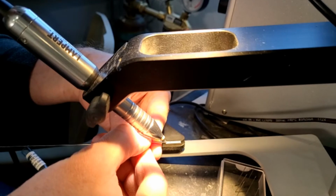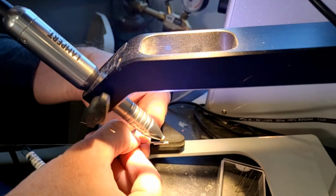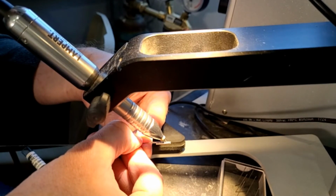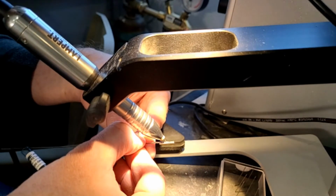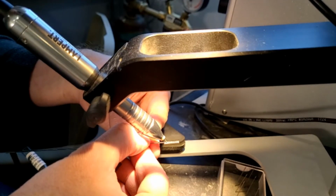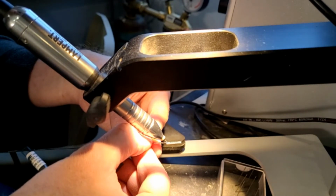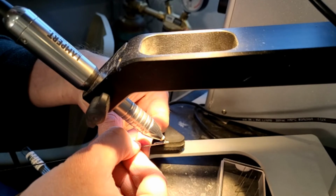The worst thing that can happen is this tube falls off in the mouth. So I want to make sure. And of course there is pressure on it. So again, that's why we're using 040 wire. Again, since I spread this out, it's not going to be the most beautiful weld, but it'll get the job done. Because if y'all have done welding where you stack the welds on top of each other, like just keep going down in a straight line, oh, it's a beautiful weld. It'll make you happy.